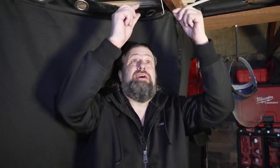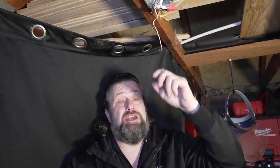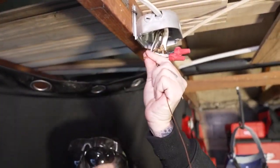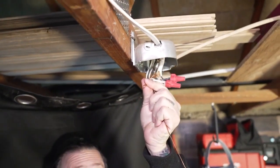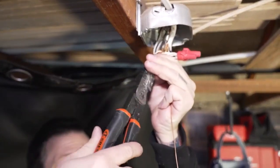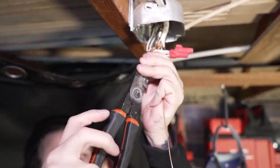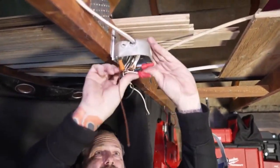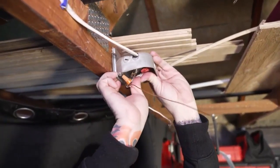Let's get the light fixture prepped so I can get it up here. I'm going to put a bushing to run these wires through, so that way it hangs up there and we don't chafe the wires with the sheet metal from the light. That ground wire is jammed up in the box and it's pretty short, so I'm going to extend it out so we can get it up into the fixture. A nice good little twist on that — I'm going to fold this all back up into the box so we can get everything connected back up.